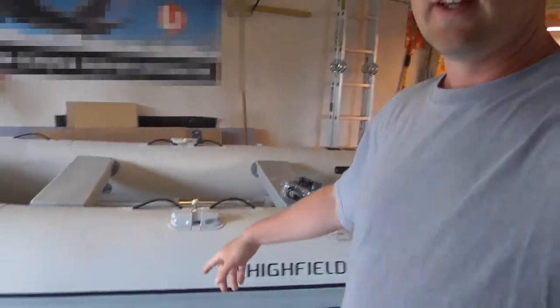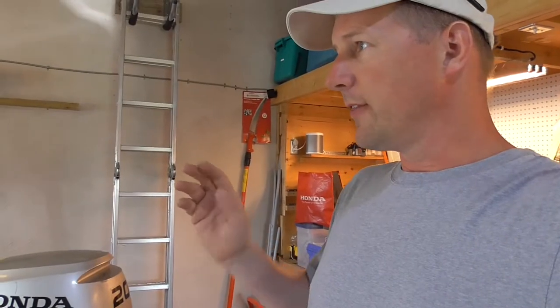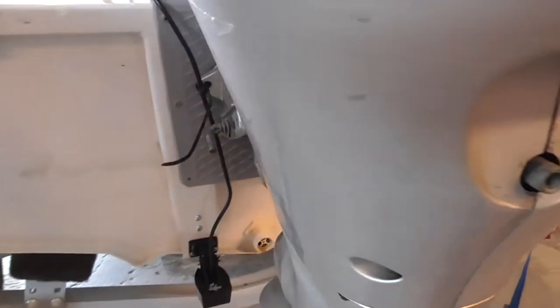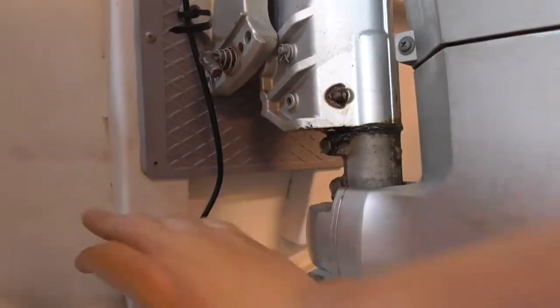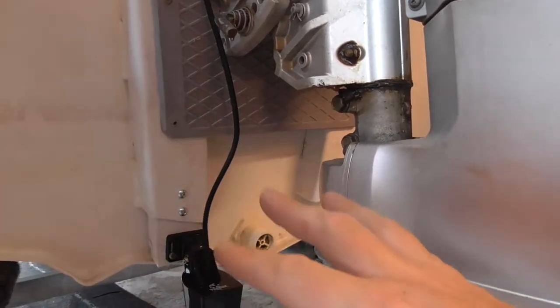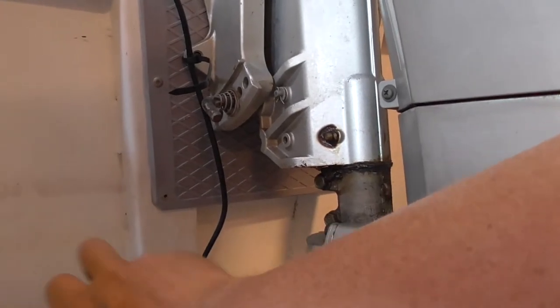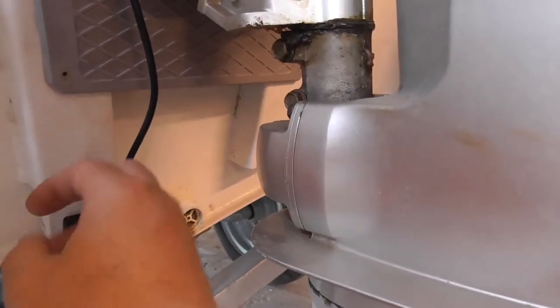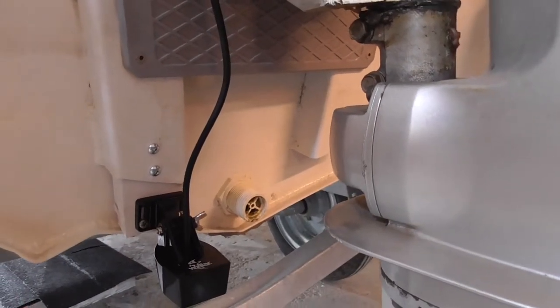Why are we standing in the garage in front of the Highfield? Boating season snuck up on me real quick this year and I didn't get a chance to install this on the big boat, so it was sitting in the box in the garage. I thought I can't let it sit there all summer, so let's try it out in the Highfield. On newer Highfields they actually put a mount down here for the transducers, but I don't have one — must be the make, model, and year. So what I did at the motor mount area, rather than drilling through the hull below the waterline and sealing it with sikaflex as Vexilar suggests, I used a couple chunks of hollow channel and a piece of high-density plastic I had lying around, cut it, wedged it in there, and threw a couple of screws in to hold it in place.